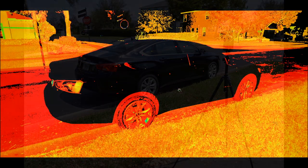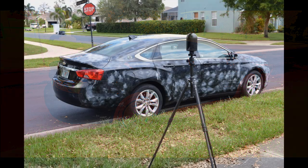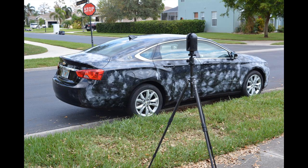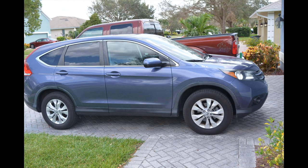With some scanners, you may get a result that looks like this. In the case of the black car, the albedo of the surface is extremely low, so you need to help the scanner out. One tip is to apply a powder like talcum powder so that we can increase the reflectability or albedo. As you can see here, the car was lightly dusted and the resulting scan looks something like this. Many times professional-grade scanners will be able to scan these types of surfaces much better because they are made differently. The good news is that most cars have a healthy coat of road dirt on them, and this helps the scanner see them without the need to apply any powder or other material to increase the reflectability.